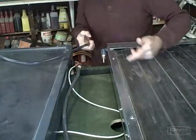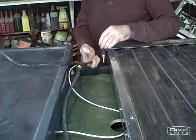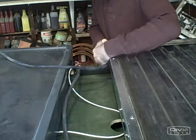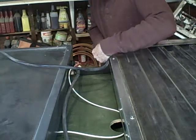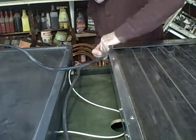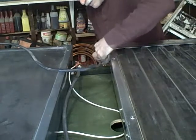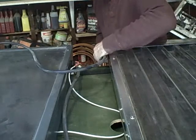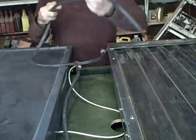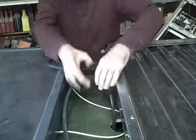This is the trickle-down collector, so the water's going to come in from the top. So in this case, the supply line is going to go into this top fitting, so we just press that into place. You can feel free to move these things around so it's easier for you to install the supply lines and the return lines. This is our supply line, and we have a hole right here, so we snake it through the hole and connect that to the pump.